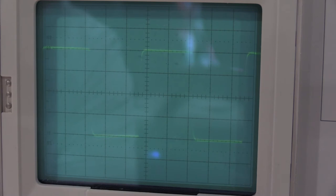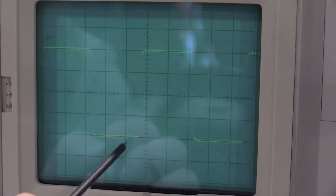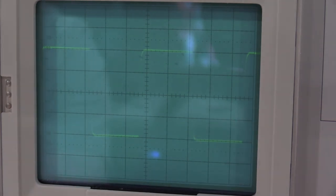So we set it to AC now. And now it wants us to check invert. Oh, it's checking for amplitude for polarity gain, so you may need to readjust positioning. However, our amplitude looks perfect, so we do not need to adjust polarity gain. And I'm judging that here and here, because I would be referencing here and here otherwise, but I can move the position here real quick. Yeah, I need to adjust that a little bit more, actually. No, there it is. I was just off a little high.